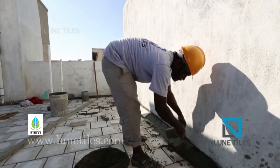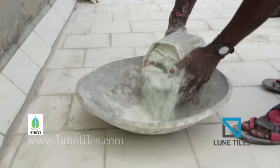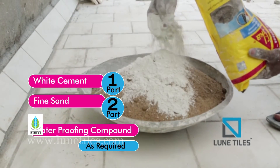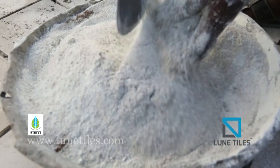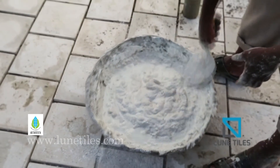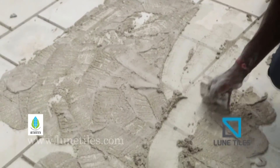Paste the compound on the parapet wall along 45-degree angles. To fill the gap between the tiles, prepare a soft mortar mix with 1 part of white cement along with 2 parts of fine sand. Also add waterproofing compounds while preparing. Instead of fine sand, you can also use white sand or marble powder as an alternative while preparing the soft mortar mix. Fill the soft mortar mix consistently over the gaps between the tiles laid.